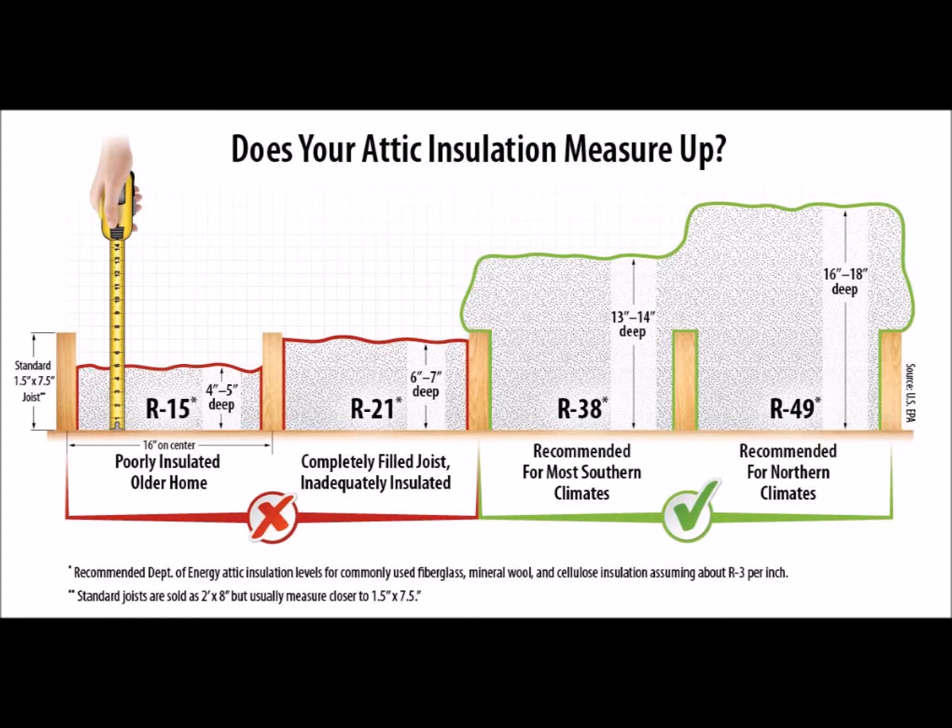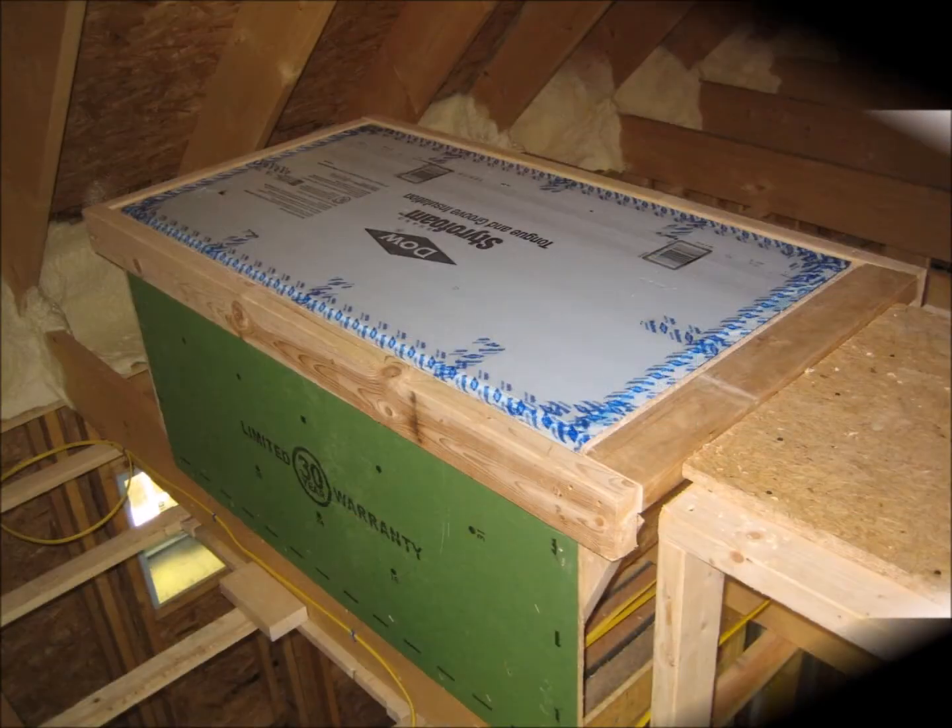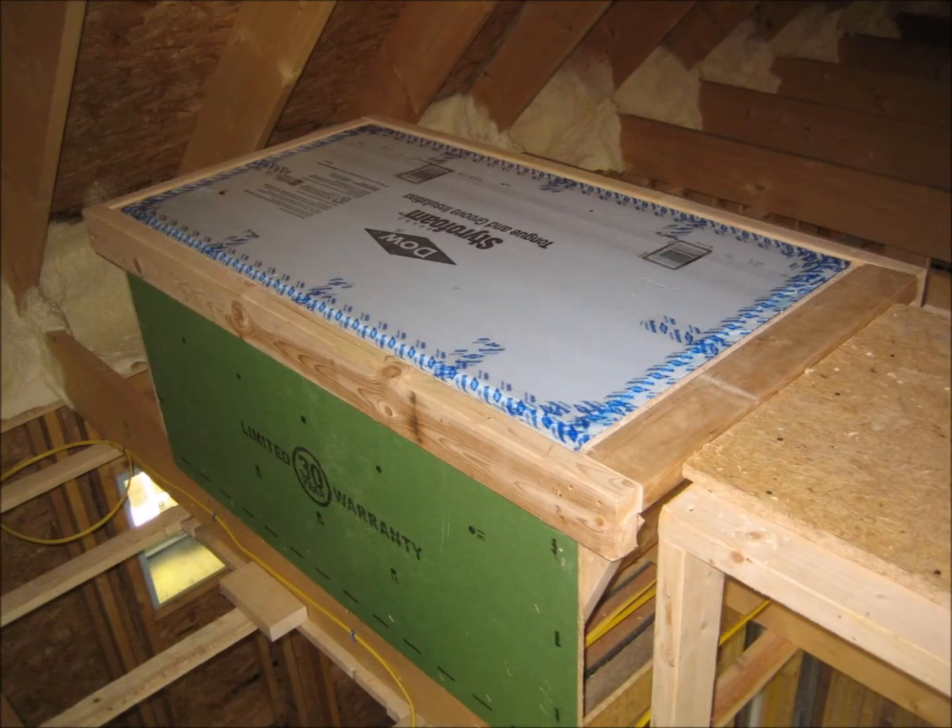While you're in the attic, check the hard to see areas, which in turn are the hard to access areas, because this is where air deficiencies will often occur. This applies regardless of the type of insulation observed. The level of insulation may be considerably lower at far corners compared to the easy to access areas, which is more typical than not. Needless to say, insulation should be evenly dispersed throughout.